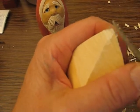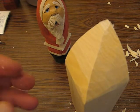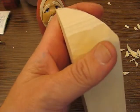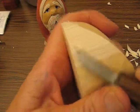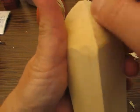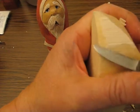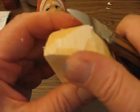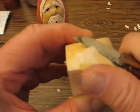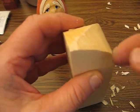As I mentioned in my talking video, if there's something you don't understand, just let me know and I'll try to incorporate that in my teaching videos as we go along. We're going to make another cut and clean this all up, trying to leave that crest as straight as possible. You can turn it around, pull it towards yourself, and use your thumb as a stop cut — make sure you put your glove on and a thumb guard.